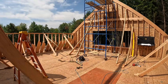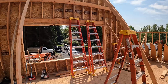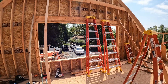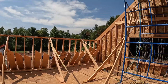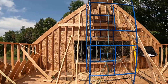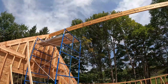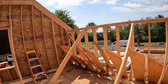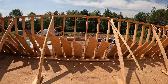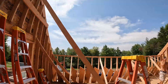Alright guys, we are back at the new job. I just got here with some material — still have it down on my truck. The guys went around and plumbed all these walls, everything is level and ready to go. They set a scaffold up so we can get these rafters nailed in to the LVL ridge. They're throwing rafters up in the wall bays here, about to throw some up on this side, and then we are going to get all of these rafters in.